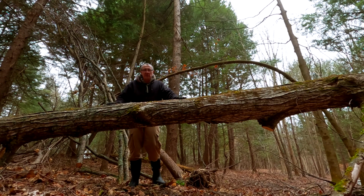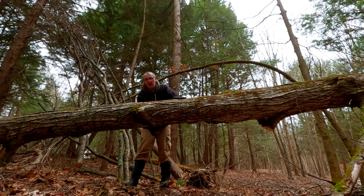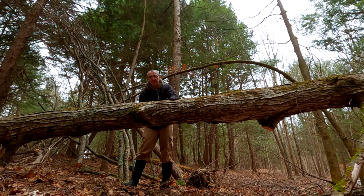But the other approach you want to take is you want to cut down maybe halfway from the top, or a bit beyond half perhaps, and then come up from the bottom, and then when the crack opens from the bottom, it's splitting this way, so your saw blade isn't going to get caught in there theoretically. So we'll see if that happens.